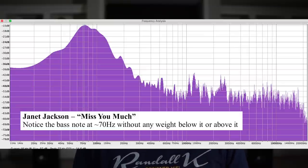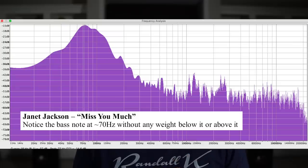Janet Jackson's 'Miss You Much' — I noted good punchy mid-bass, which is what's on the disc. I ran the spectrum through Audacity: most of the meat of that song is above about 70Hz, and below that the response starts to fall off. Kick drums are typically in the 50-60Hz region giving that real grunt, but I didn't notice any grunt — and going back to the actual spectrum, there isn't any 50-60Hz content there, which explains it. In terms of accuracy, I feel like these speakers are doing that job well.